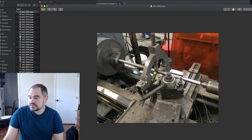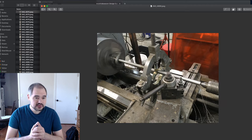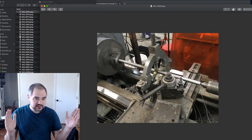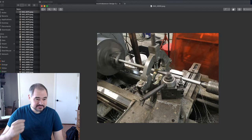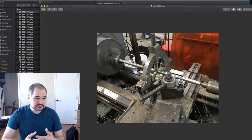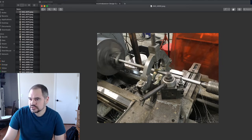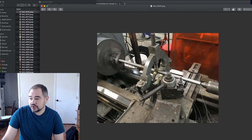Because these joints are so thin, I also have to have a steady rest set up to keep the part from flexing. You can actually feel it when you hit one of those harmonic nodes — the chatter keeps getting louder and deeper. Eventually you could damage or ruin the part, and since these are a significant chunk of material, that would be less than ideal.